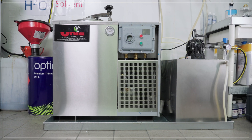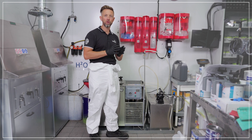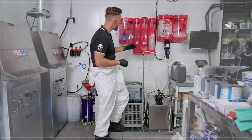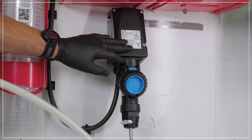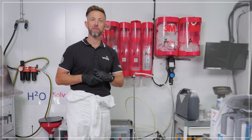The machine should be electrically connected to an ATEX approved junction box with an isolator switch, or an ATEX approved plug and socket. This ensures that you're fully protected from any flammable atmospheres.